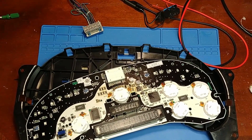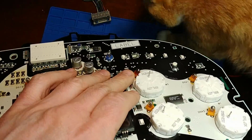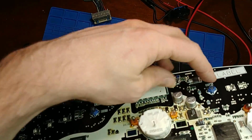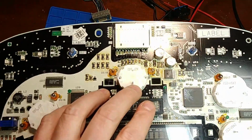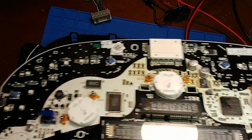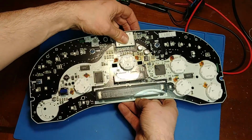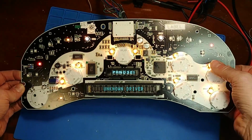Okay. All right, so the light bulbs have all been replaced for the backlighting. I am seeing some tungsten darkening, which the factory OEM bulbs do not get, but they're actually a really high quality bulb that is hard to find third-party aftermarket. So I'm not surprised after 5 years of use there's some darkening. And also the sockets have melted. I guess they're not using the same quality plastic as the OEM, but I don't know if the owner of the vehicle may have smelt the burning plastic, but let's see if any of them work. Yeah, so all the bulbs are still lit, which is, again, pretty good for 5 years of use.